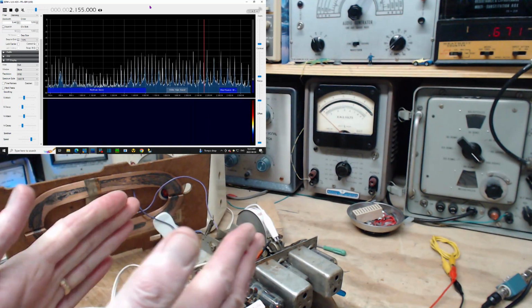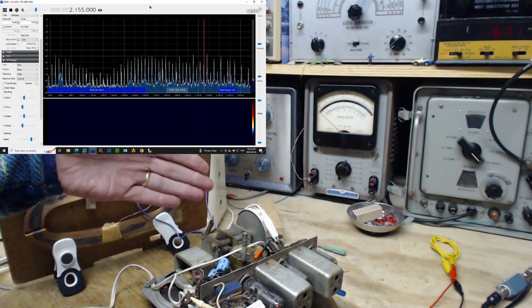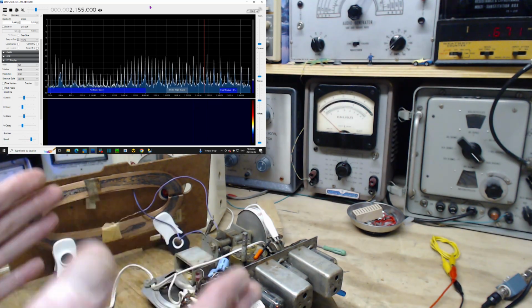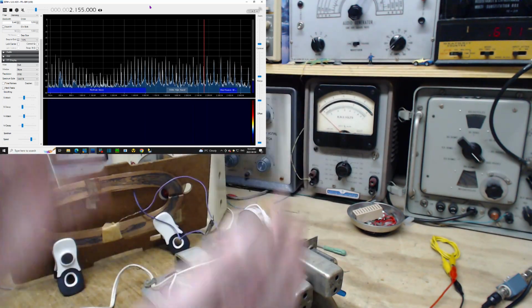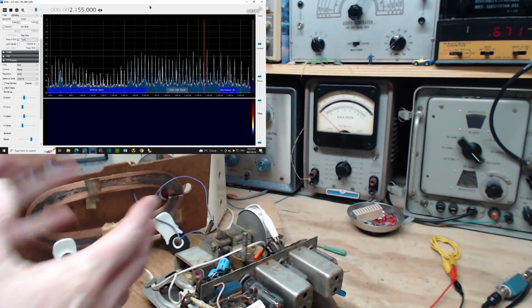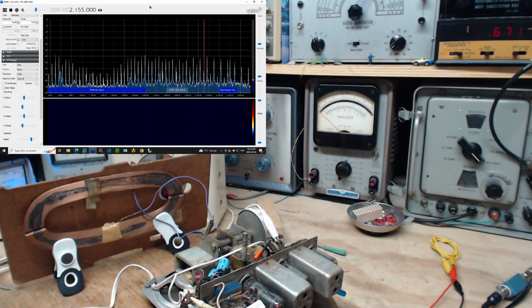Could be a very wide bandwidth coming into the radio, maybe because it's not limited by the antenna anymore. And the broad bandwidth is just letting too much crap in with the signal you're after. And you want the tuning curve, so stuff out here isn't heard. But if the tuning curve is like this, you hear it. So mouth open too big, too much noise coming in with the station.